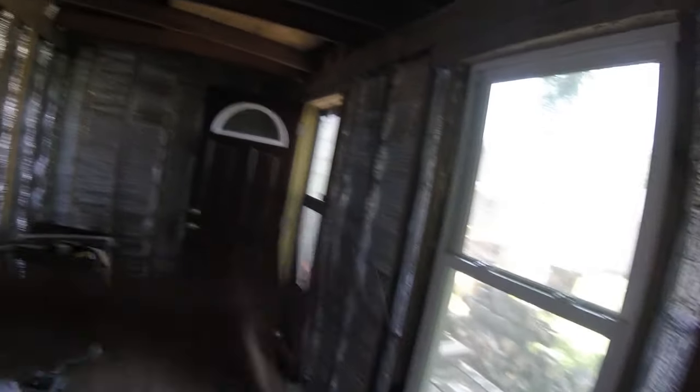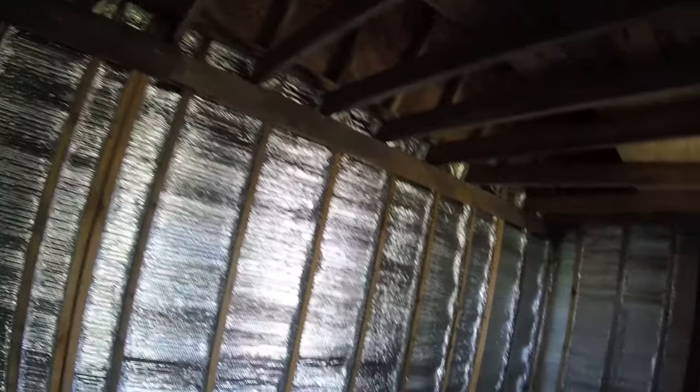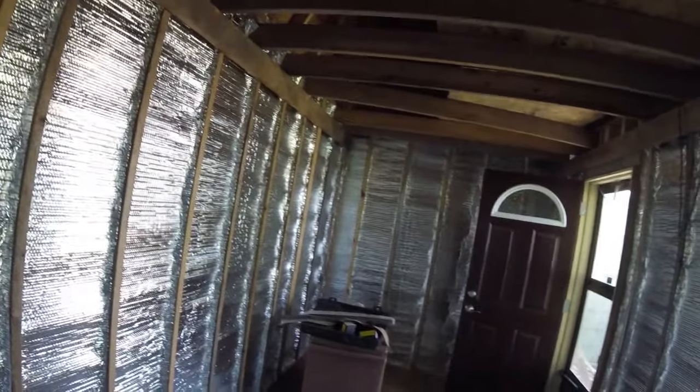This is going to be basically just a small camper RV. I'll have to keep in mind the appliances I'm using — it's just going to be basic running. If I run more than two things on one of the 15-amp circuits, it's going to flip the breaker. So I can run a major thing on one 15-amp circuit and a microwave or toaster oven on the other. I'll just have a basic plug on each side and some basic lights running.